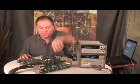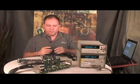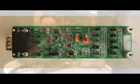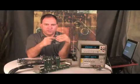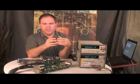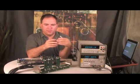Plugged into this board you see several different test modules. Here's a test module — it's really just simulating a module that you would design using the PGA309 and 308. There's a sensor emulator portion of this test module. This switch will control an emulated sensor's minimum output and maximum output.